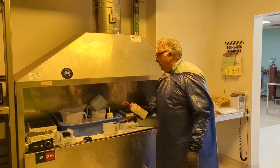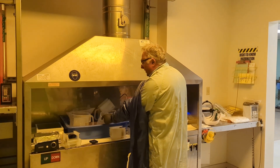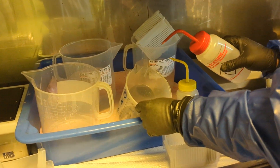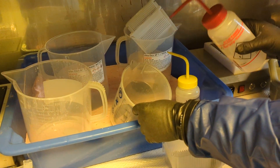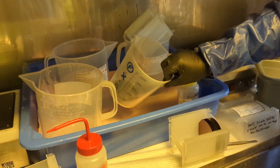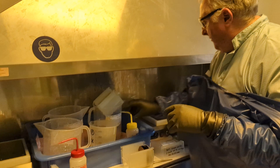We measured less than 20 angstroms, and we're going to remove the photoresist with acetone. If you want the hot plates off, definitely do this under the fume hood. You just squirt the acetone in there and it should come off. Now, if you over-post-baked it, or if you used reactive ion etch which makes the resist really hard, that can be an issue — but this one is probably fine.